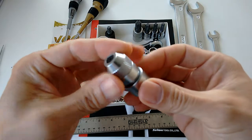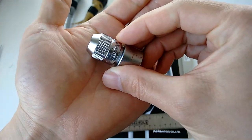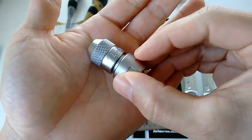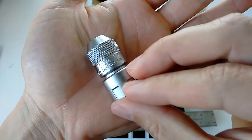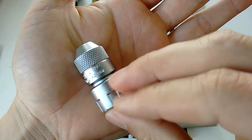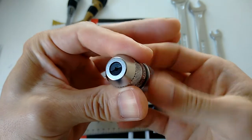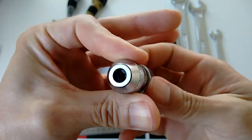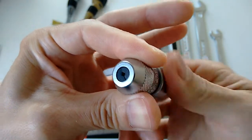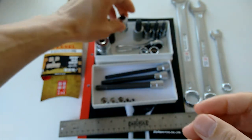Here's this tap holder. I featured this in another video. This is their other size, number 1. Part number 3131A. Manufactured 2017 February. 3/8 drive. So simply rotating this will open it to whatever size tap you may be using, and obviously a 3/8 drive, so you have various ways to drive that.